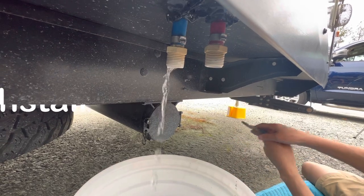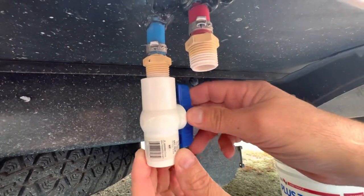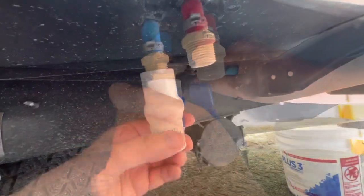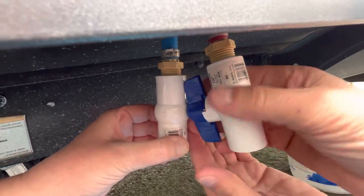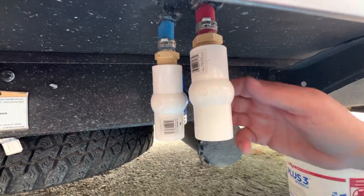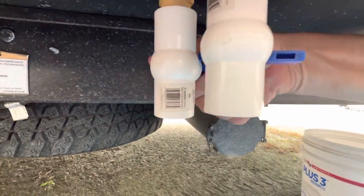Troy is going to show you how easy it is to just replace them. After you pull the caps off and drain the water out of the water lines, you can go ahead and put these valves on. You may need a little help here because these valves are very close together and you're going to have to hold them apart a little bit. They're both installed, reasonably tight, should be just fine. At this point, take the handles and turn them perpendicular to the pipe to make sure the ball valves are closed.